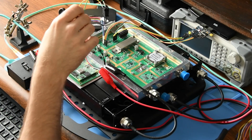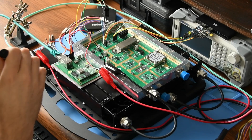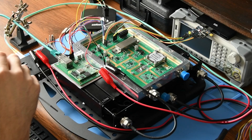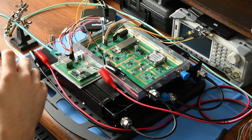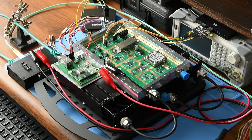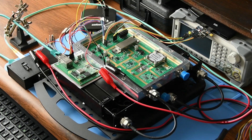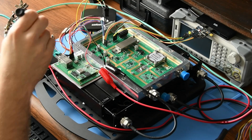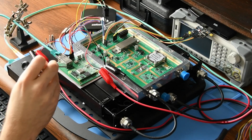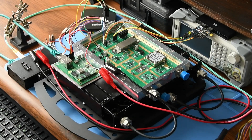This device is controlled over the Common Amateur Radio Interface. That interface is meant to carry baseband uplink and downlink, control, and telemetry data — a whole set of commands and data transfers supported by the CARRI protocol. Between the remote radio unit and the outside world you need something called an interface. I have built my own interface using a Raspberry Pi, and it converts UART between the STM32 and the Raspberry Pi to CARRI carried over Ethernet and then through optical fiber down to the baseband unit.